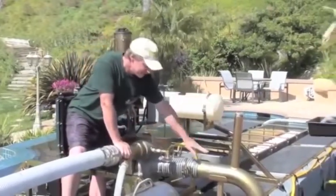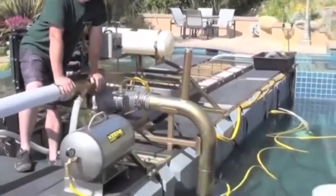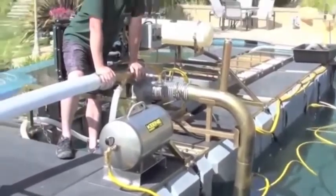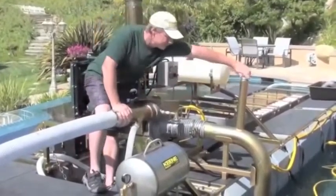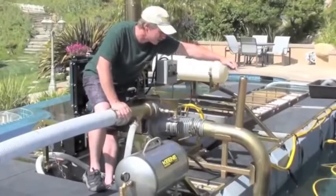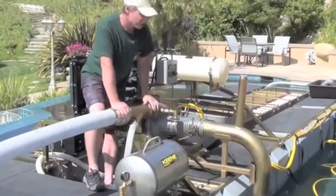This is your pump intake. On the end of this, there is a foot valve or check valve — a one-way valve on the bottom. So when you shut the engine off, you should be able to maintain a prime. Once you prime it that one time by removing this cap, filling it with water from a bucket until it overflows, and putting your cap back on, then you can start your engine.